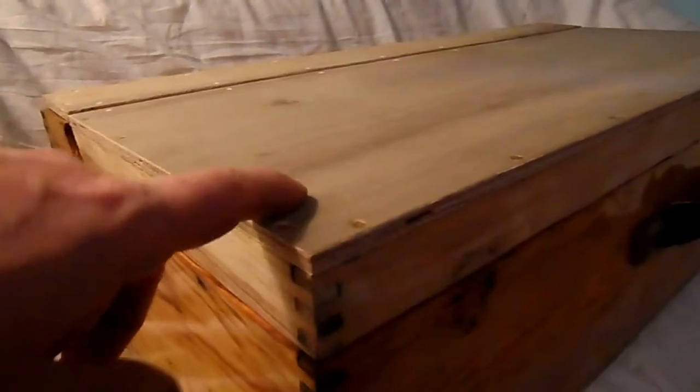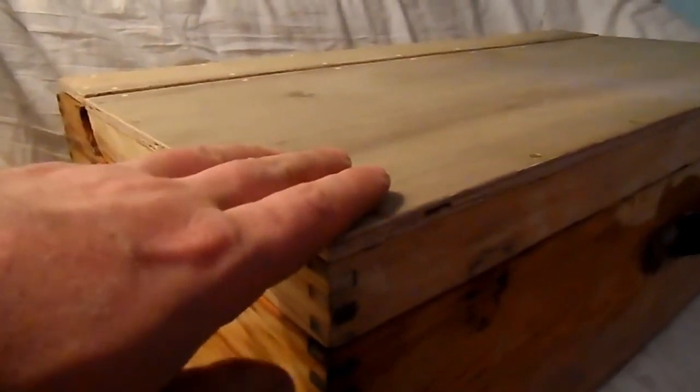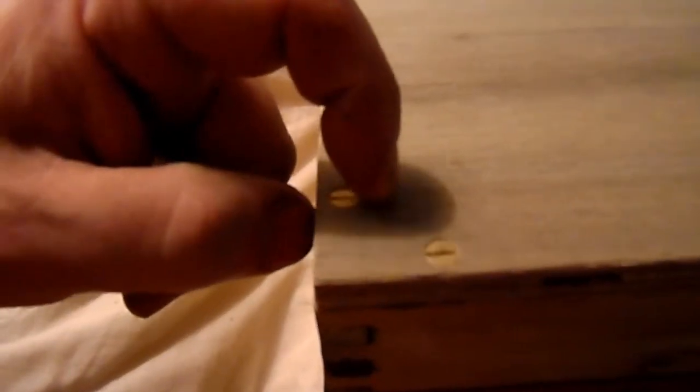I've fitted the lid to the lid frame here. That's not gone quite as well as I'd hoped. You'll be able to see here that while the plyboard has stood up reasonably well - in so much as it hasn't chipped away yet - there isn't a lot of material there, and I fully expect that to chip away at some point. So I might just go ahead and fit maybe a 10mm 90-degree mitre angle along here just to reinforce this edge and corner. In fact, I would do that all the way around the top surface.